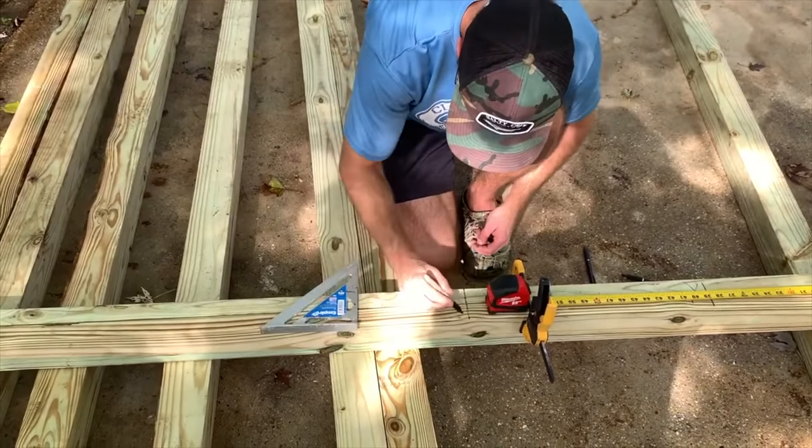So this was the last row of shingles that I was able to install where I could actually nail through the target nail zone. So after installing this row, I took my ladder and I accessed the shingles from below, and I used a utility knife with a hook blade to cut it flush with the fascia board on the ridge edge of the shed.